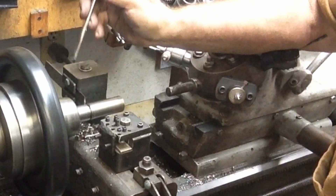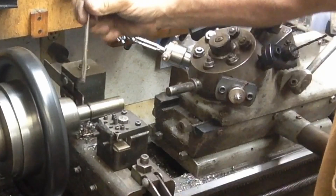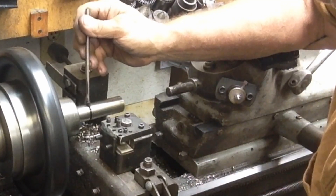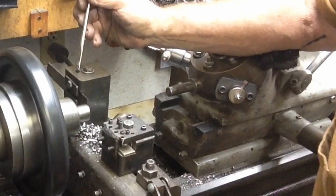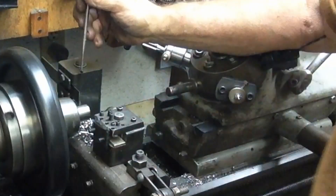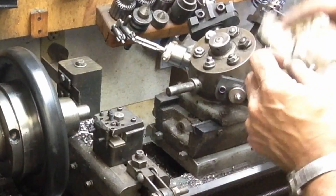The fourth position is the first of the internal drills and there are two of them — positions four and five. The first one is a standard drill and I make sure these are sharp; we want a good hole through them. The fifth is a drill that's been re-sharpened to have a flat bottom, which gives me a flat face in the bottom. Those are both tool holders I purchased, probably off eBay. They're both one-inch shank tools on this one-inch shank tool post. They're a little bigger than I like — they're designed for a larger turret lathe and just don't work quite as well for my applications, but you have to be aware of how you're positioning them on the tailstock to make sure you get alignment and they clear on the backside as they rotate through.